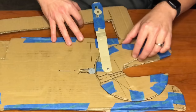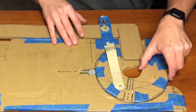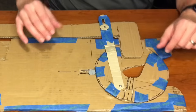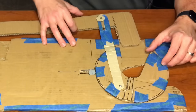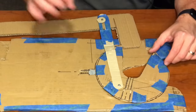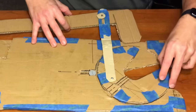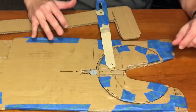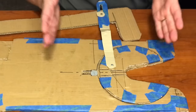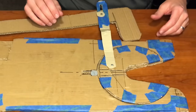So it's really important to note that with the jaw locked in the down position, the hammer is the piece that makes the mechanical bind and the lock there to prevent it from accidentally opening on the way up. So if for some reason the hammer didn't activate all the way and it was sitting down like this, then theoretically as you're lifting the train and the train starts to articulate, this could just accidentally unlock and force the claw open and drop the train midway through. Vekoma planned for that, because that's the reason when you clear the station, the station brakes close, just in case the catch wagon accidentally lets go of the train for some reason.